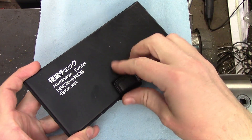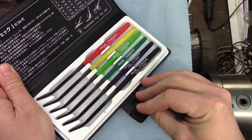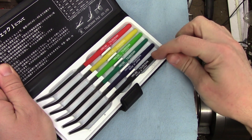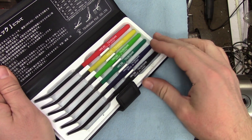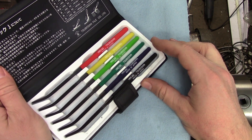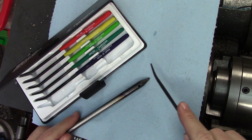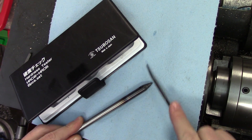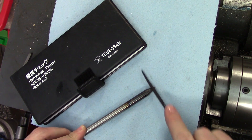To check the hardness, I used my hardness testing files, which I have shown off in other videos. These files are hardened to different points from 40 Rockwell C to 65. If the part is scratched by a file, you know it is softer than that number. If the file skates across the surface, the part is harder than that number. Starting with the 65 Rockwell C file, it is immediately skating — so I got that part as hard as I possibly could. It scratched off a little of the black scale, but it didn't touch the metal.